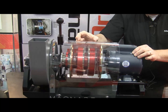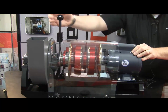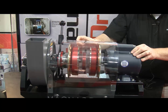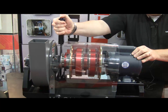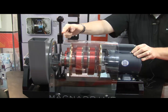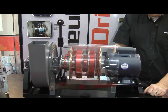As we increase the speed, we change the distance between the magnet rotors and the air gap up to full speed. Now we're magnetically coupled — full speed on the fan. You can also go anywhere in between, increasing or decreasing the speed depending on the signal coming to the Beck electric actuator, for process control and energy savings.